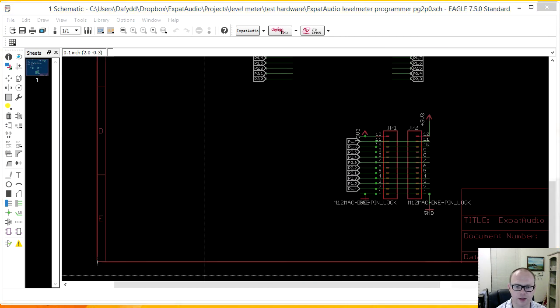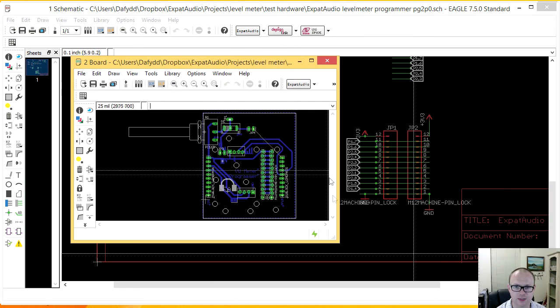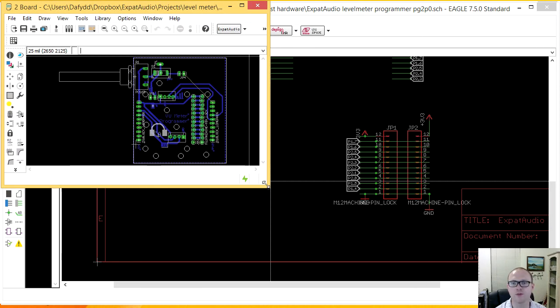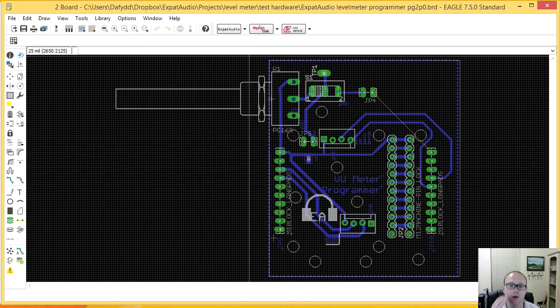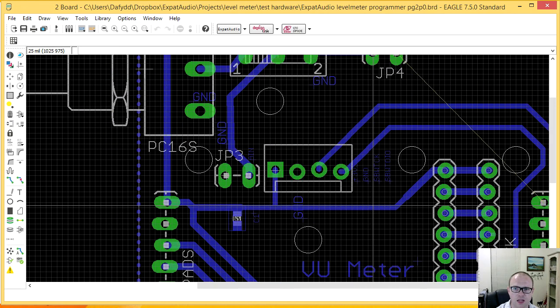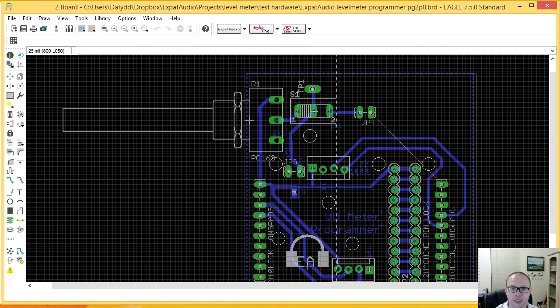And if we look at the board, it looks like it's much smaller for starters, because I was able to trim that out. And I actually moved everything to underneath the board. The reason I moved everything to underneath the board is, I think on next week's show, we're going to create this PCB using my laser engraver. So if I can make everything single layer, or near to single layer, with maybe a couple of bond wires over, we'll make it in-house. I could send this off to be manufactured elsewhere, but truly, I'm not certain it's really worth it for a one-off board if I can simply manufacture it at home. The other thing is that a lot of these trace widths are wide enough that I could self-etch this at home. So stay tuned for that.